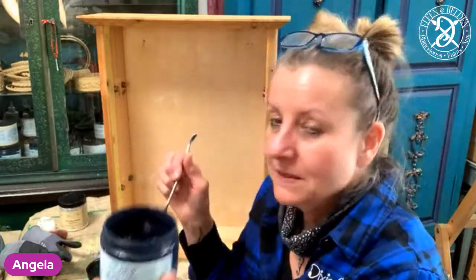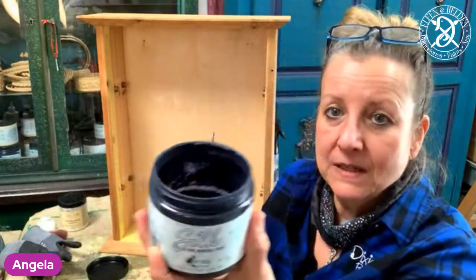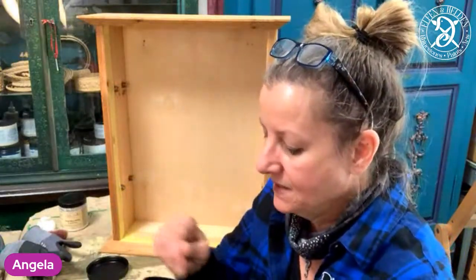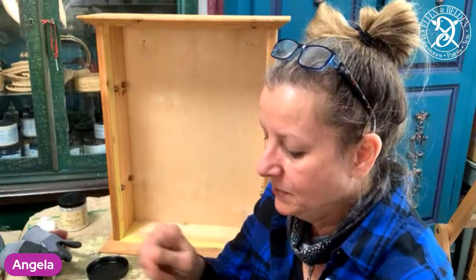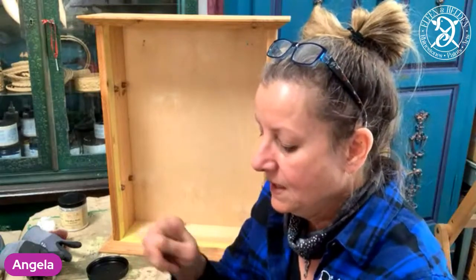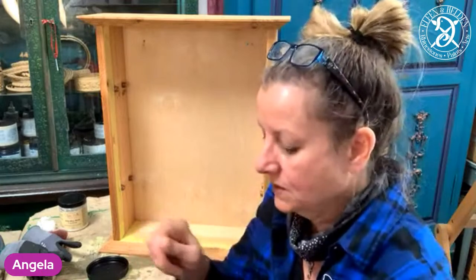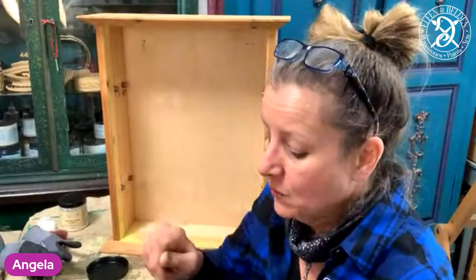It is water-based. So also, you know, when you use it, mix it up nicely. I'm just stirring it up nicely because with water-based products, they may separate when they stand. And you want to have all the goodies mixed up. All-in-one means it has a built-in base coat. The base coat in here is basically a stain blocker.